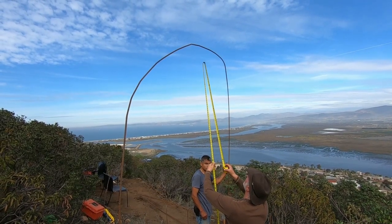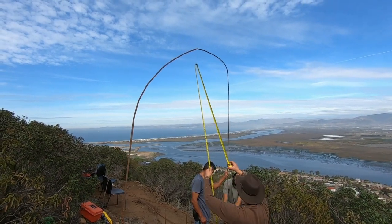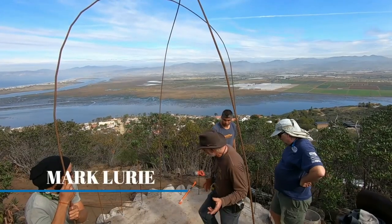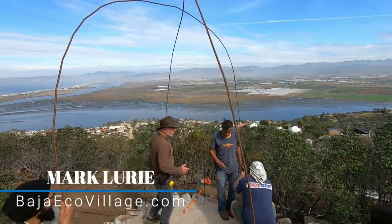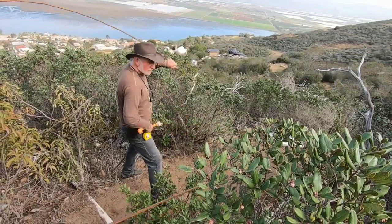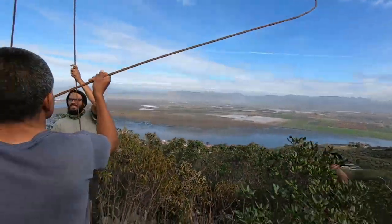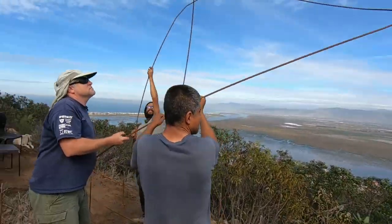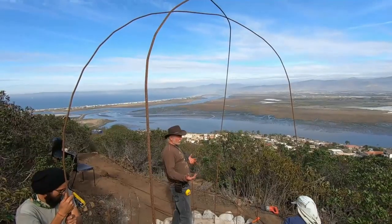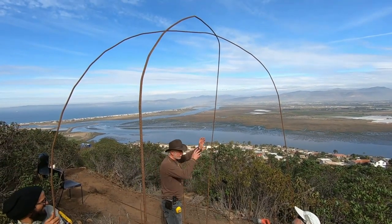So ten feet right here — that's pretty good, pretty darn big. Here we are now cutting these longer verticals and running them all the way over the top and down the other side of random lengths. We're going for about a nine to ten foot high tank, which is a little taller than the diameter at the base. That's accomplished by cutting these rebars to random lengths and putting them in. Then we'll shape our stone as we go and put on our access.